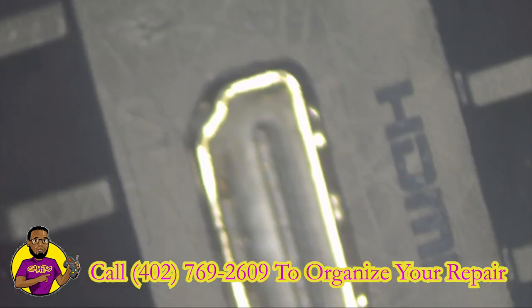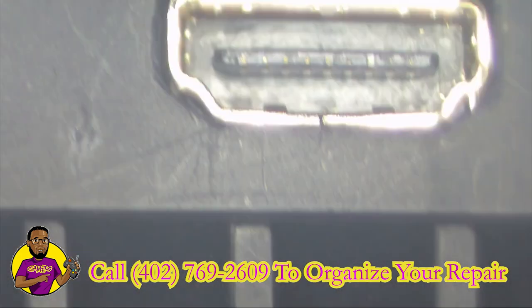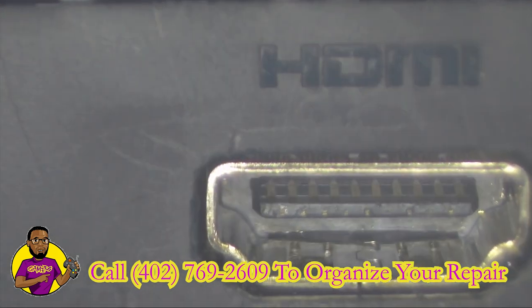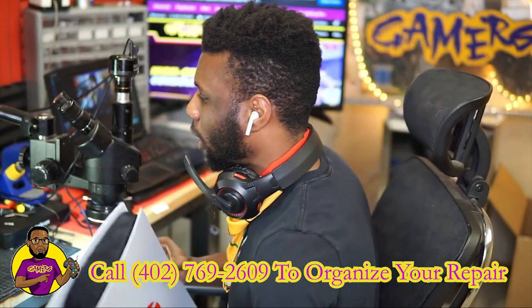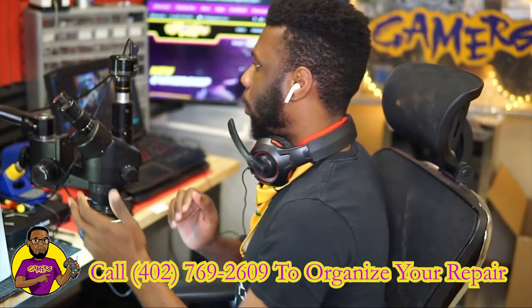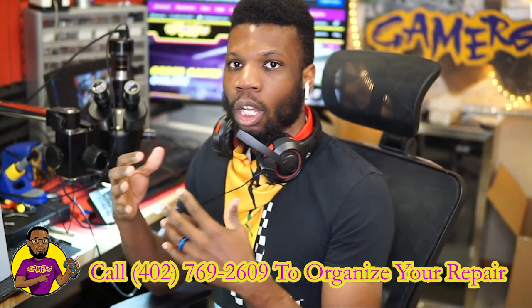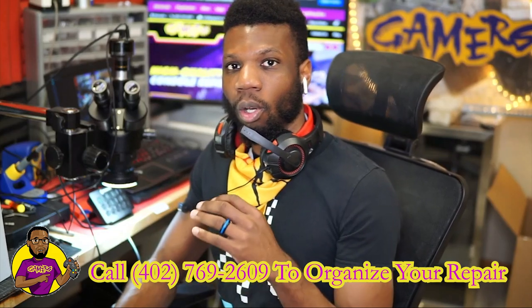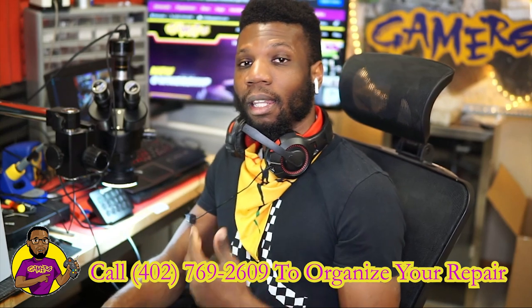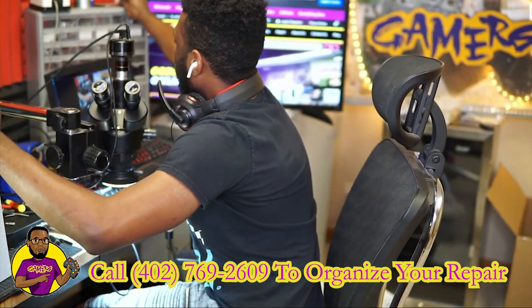As you can tell, let me turn the camera around to get a better angle — there's nothing really noticeable that's damaged. There's really no telling if it's something like a broken pin off the motherboard, a retimer chip, an encoder chip, an EMI filter — it could be a number of different things. I did try resetting it. If you guys are having similar issues, always try to reset the console first: plug into the power, plug in your HDMI cable, hold down the power button until you hear the second beep, then let go. If it doesn't show anything in safe mode, it's more than likely going to be something internal.